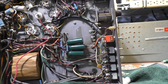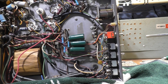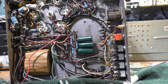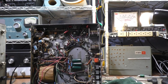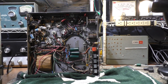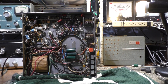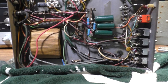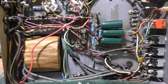Except for a bigger transformer, it's almost part-for-part. The fuse is 20 amp on the 750 and 15 amp on the 500, but other than that, so far it's almost part for part. People looking to work on a 750 and can't find the schematics — look at the 500, it's the same thing. It's grounded grid — well, not quite grounded grid — they run some resistance in there to develop some negative bias on high, medium, and low, playing with the grids on both the drivers and finals. On the 750, they use two taps on the high voltage transformer — a high side and a low side.